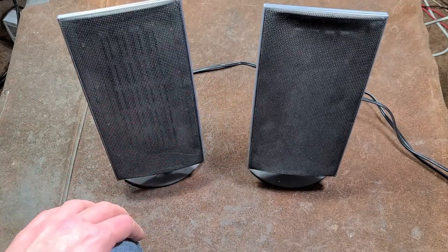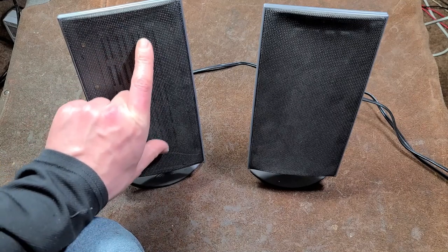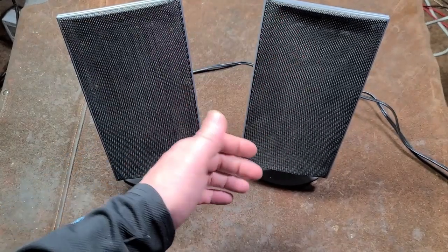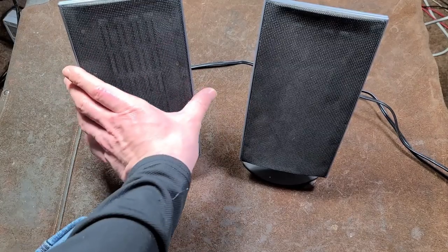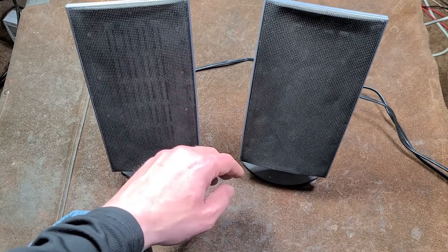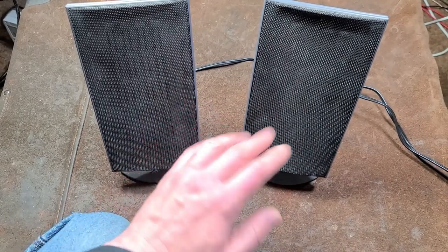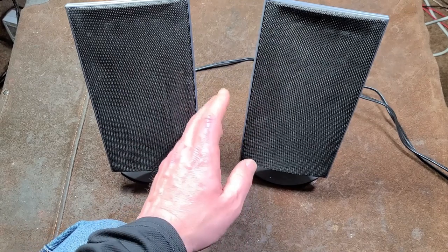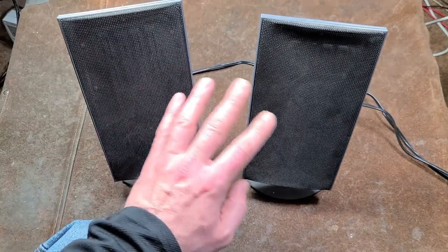These really are Eminent Technology drivers — Monsoon ordered just this metal panel from Eminent and created packaging for it. That's the aficionado angle: you're getting Eminent Technology 4x8 drivers, and for just a bookshelf system these would be fantastic. You do need a real amplifier though — on my Onkyo THX receiver the volume scale is relative, going from negative to zero and above, which is different from old receivers going 0 to 100, but the point is you need a substantial amplifier to make these really astounding.